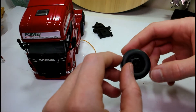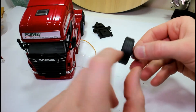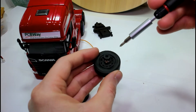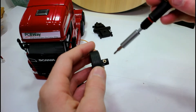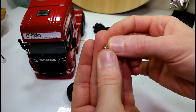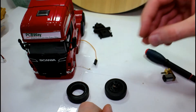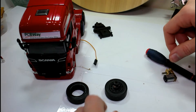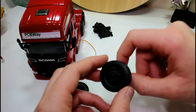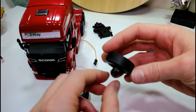Last night I designed up a few parts to 3D print so we can get our driven motors on the front of this truck. The first thing we needed was a wheel — pretty much the same design as the original except it's wider to take the Siku tire. On the axle-mounting side I have a 3mm D-shaft in the center, and on the other side I 3D printed a hole to fit a brass insert, which I just glued in.